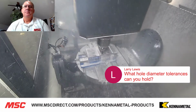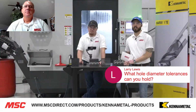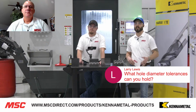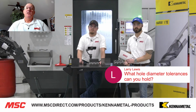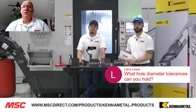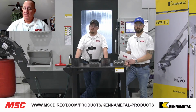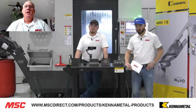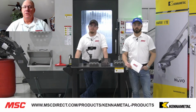Yeah, it's absolutely sprinting through this operation. And hey, we got Larry coming to join us. Thanks, Larry, for your question and for joining us on the stream today. Larry wants to know, what hole diameter tolerances can you hold? Well, that's a great question, and that's always a concern, especially if you're going to use a drilled hole for a finished diameter. Just like anything else, cutting tools have a tolerance on them as well. But most of the time, I would say this tool is usually within about 1/1000th of the diameter of the drill itself.